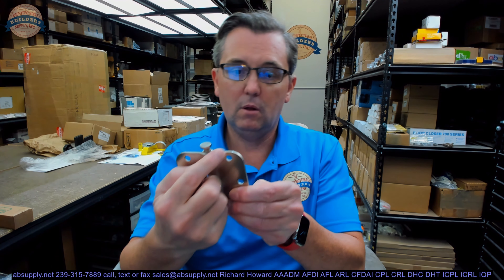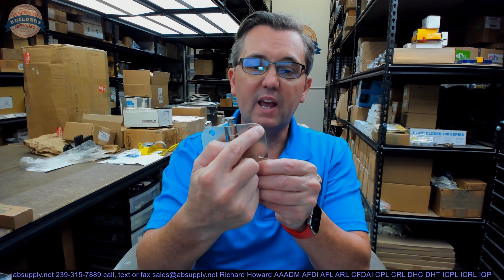How did that get there? Well, 5/8 is the radius, which makes the diameter 1.25 inches. They use an inch-and-a-quarter diameter router bit when routing the hinge preps in the doors and frames. A pre-hung shop or wood door manufacturer will use a 1.25-inch diameter rather than a half-inch diameter because it's larger — meaning you remove more material in one tool path. More efficient, quicker. That's why you get a 5/8 radius on the preparation.